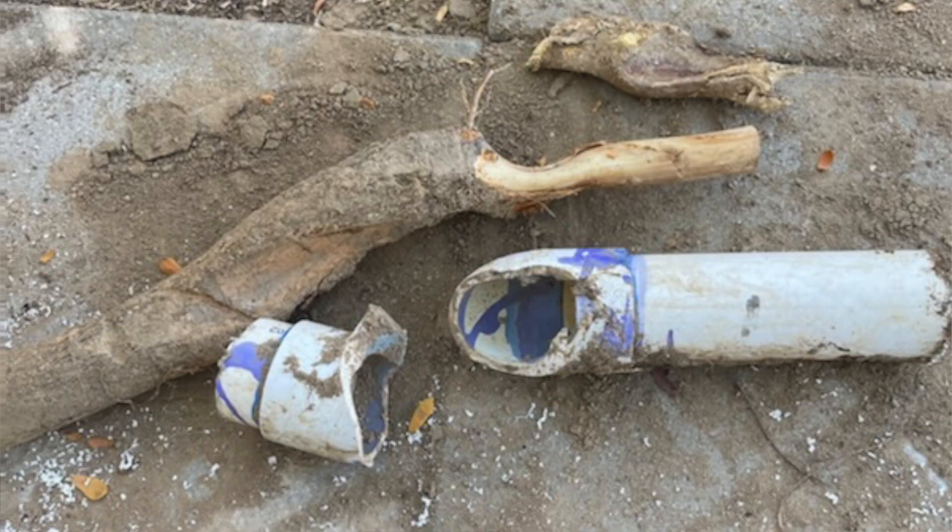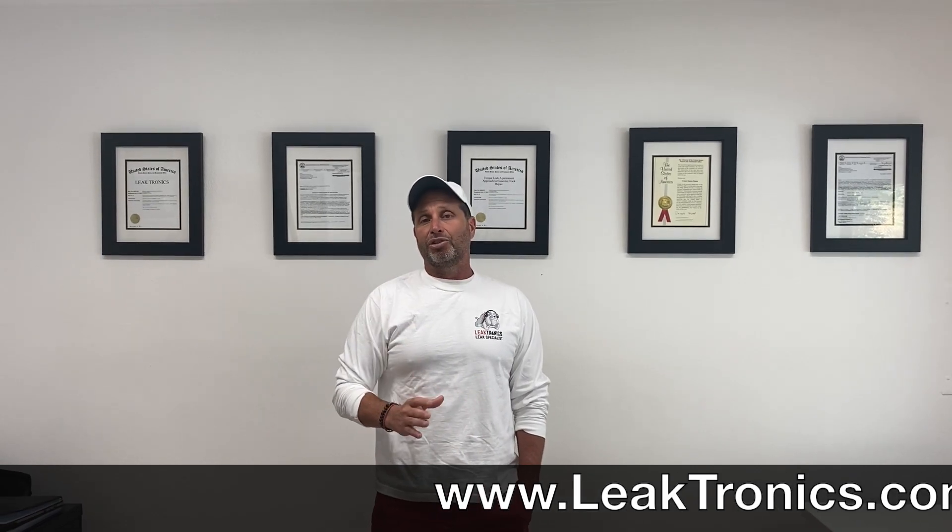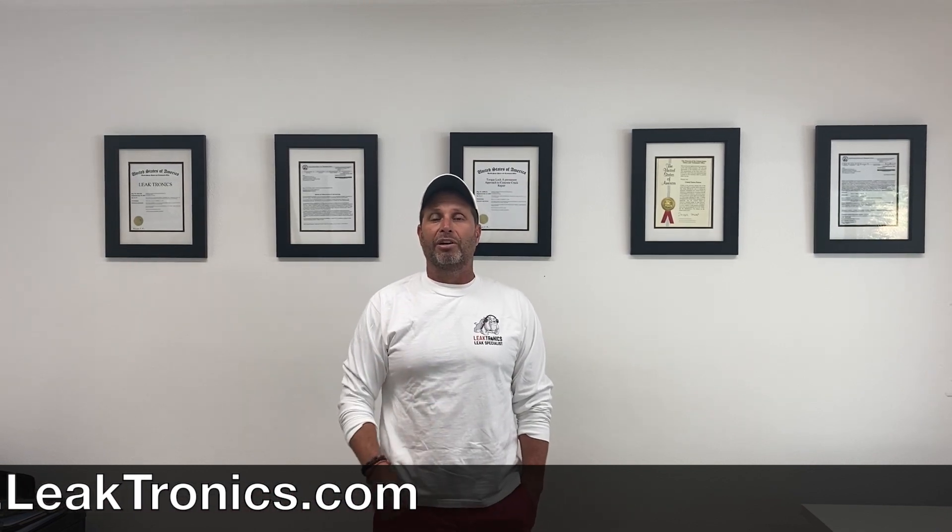We don't normally preach using cameras to find leaks, but when they're as pervasive as this — when they're in your face like this — he used the diagnosis of air in the suction side, knowing we probably have an issue, was able to put that camera in and get it through some pretty tight spots. He removed the valve, put himself right over it, and did the repair. Here's what the actual fitting looks like after he cut it out — it was a complete separation. For more information, visit leaktronics.com and always check out our YouTube videos.